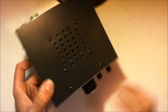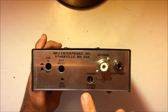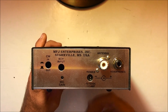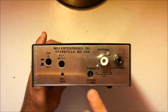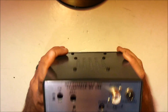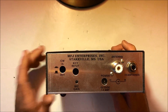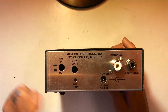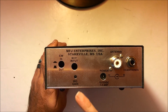This can also be used mobile if you so desire. On the back, here's your headphones — quarter-inch headphone jack — and your power input. This requires 12 to 15 volts, 1.2 amps; the manual states 2 amps, so you'd want a little overhead to have enough power. It doesn't draw much since it's only a 10-watt QRP. Center pin positive — pretty standard. And you'll see the CW in and out: if you put the board in and push the CW button, now you're on the CW scale on the tuning knob. And the key input for your paddle or straight key. And the mic gain — you can make adjustments here with a small screwdriver.